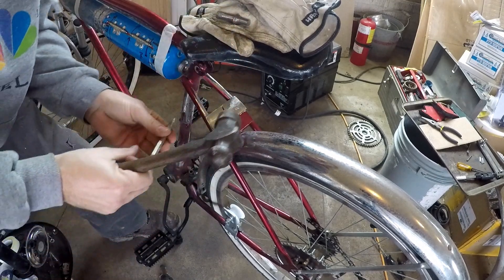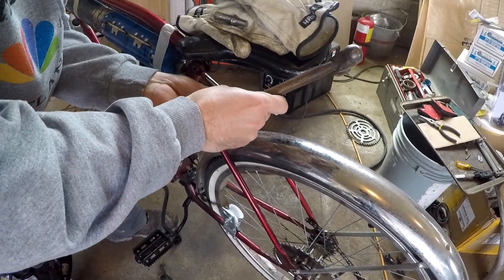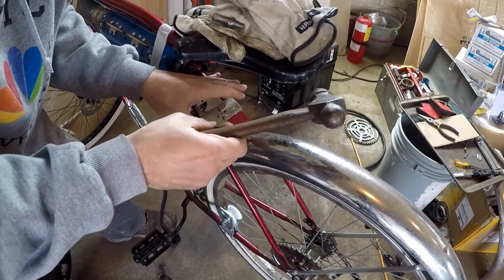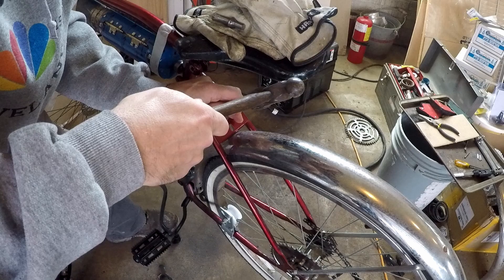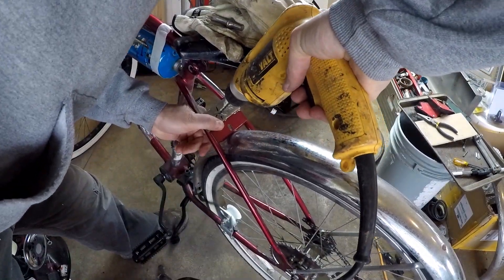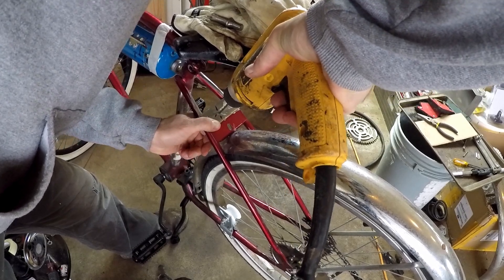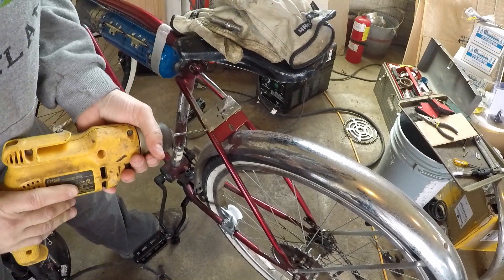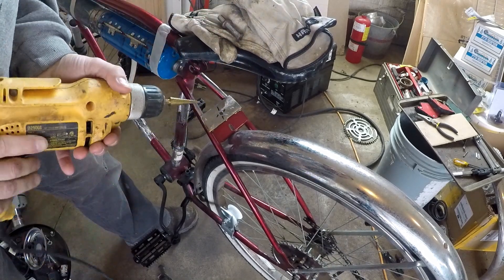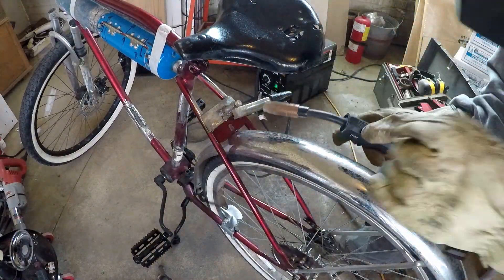What I'm doing is cutting the piece of bed frame to length so it'll fit in there, and I'm going to drill a little hole through the center — not big enough for the chisel to go through, but I'm going to weld all the way around on top and also do a weld from underneath to give it extra support. That's a useful trick: if you want extra support, drill a smaller hole through your main piece and weld through that hole into the bottom of the piece you want to attach. This is a quick clip showing the markings and how I center it.